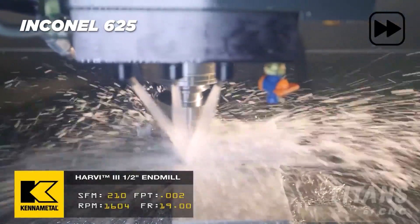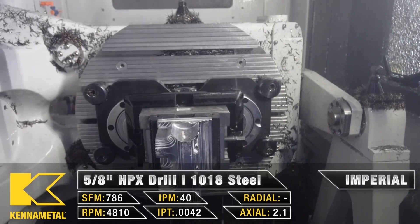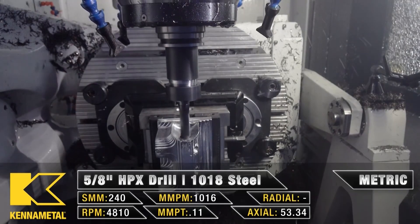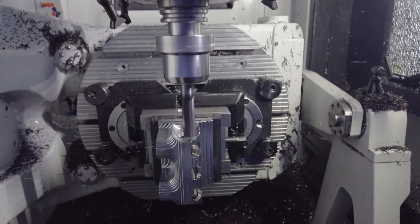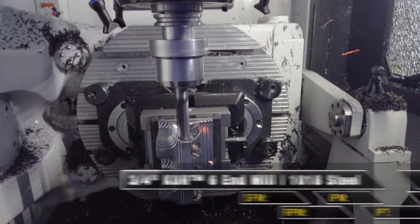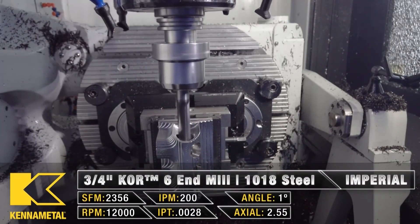You basically say: I'm going to run this at 15 minutes. The program knows at 15 minutes to take this one out — you can still use it later — but go grab 45 or 46 and run it as tool one so that you run nonstop. That's what I mean by tool management. In those cases, ceramics are absolutely amazing. It just really depends on what you're doing.